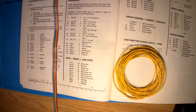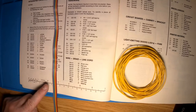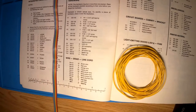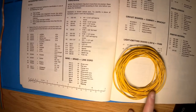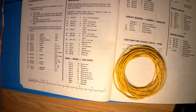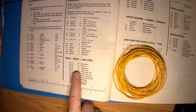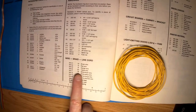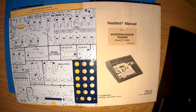Then we've got some more exciting little brown paper packages with various resistors — I suspect these are current-limiting resistors for the seven-segment LEDs since there are quite a few. Mostly quarter-watt with a couple of half-watt ones. Here's the final two bits of hardware: a multi-colored ribbon cable which looks newer than the kit and I can't find it on the parts list, so I suspect the seller just snuck it in. And this yellow wire — when I checked the parts list I thought I had way more than 20 inches of yellow wire, but then I realized this is not inches, it's feet. 20 feet of yellow wire! It just shows that here in the UK, using centimeters and meters and millimeters, you get out of the habit of distinguishing between inches and feet.